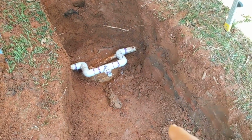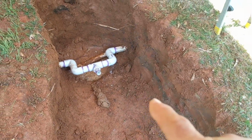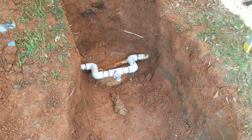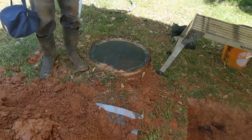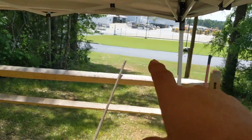So we're putting another bladder tank in, so this one will just provide extra storage. The functioning of the pump tech controller was not behaving. So we're gonna add a bladder, and it's on the right side of the pressure switch. So hopefully we get better performance. Our tanks are full. We've got 6,000 gallons of beautiful well water here, ready to be pumped out there.